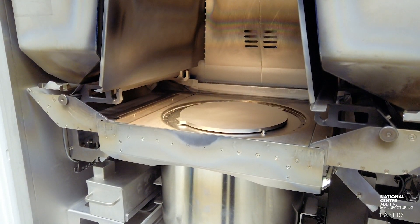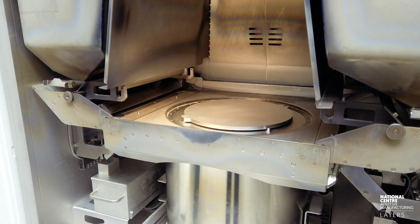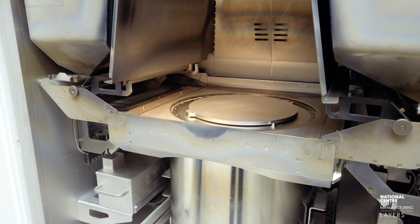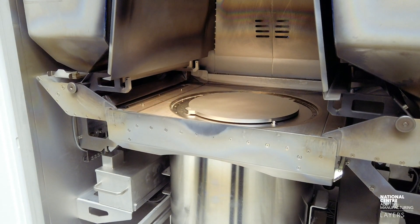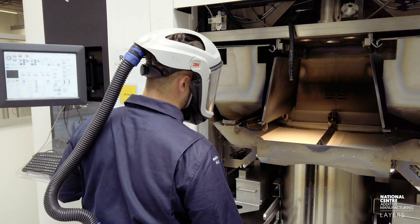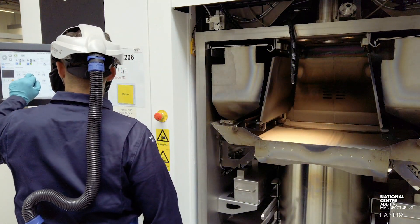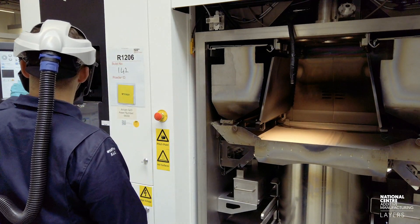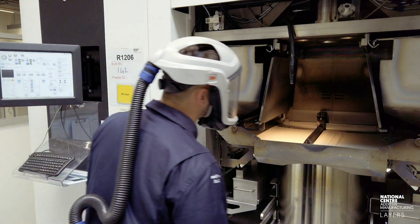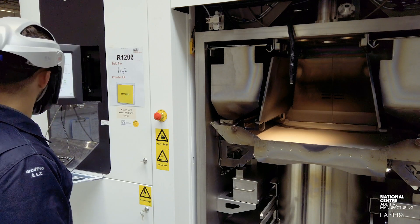What you can see there is the rake, which traverses between the two powder hoppers, spreading powder from each of them. He's just checking if the plate is level and can adjust it to make sure it's where he wants it. The rake itself travels pretty fast and is a noticeable improvement on previous generations of the machines. Here he is doing what they call a pencil line test — he just wants to check how much the hoppers are dosing and whether they're dosing correctly. He can adjust where the rake pulls powder from so that each 90-micron layer is dosing the correct amount of powder.